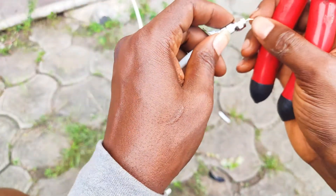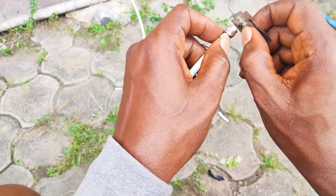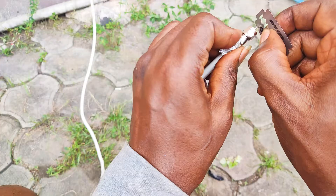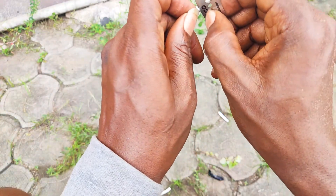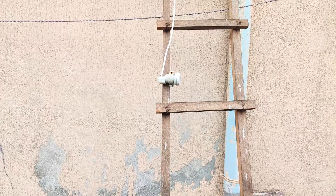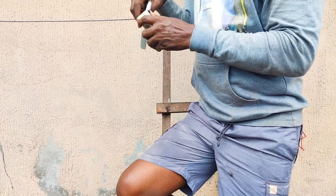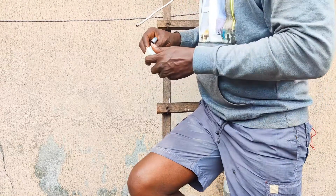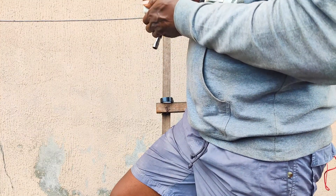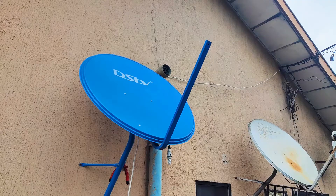As a rule of thumb, it's good to scratch out the contact area to improve connection quality. That's the extra bonus — how this improves your signal. I'll cut the excess off to keep everything neat. Most people miss putting the LNB cover on — this actually helps your dish work well. Plug it in and you're good. The LNB sealing and cover is very very important.